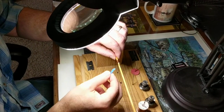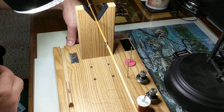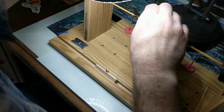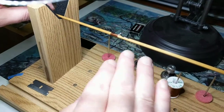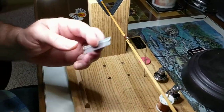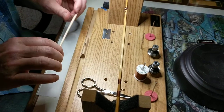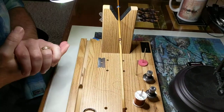Before I put these guides on, I filed down the guides such that there were no square edges and they were chamfered just a little bit so the thread rides up easily on the feet. Tools: we've got a razor blade, a pair of scissors, my nylon double-ought thread, and a little nifty fixture here. I also have a burnishing tool, just made out of wood — a soft material to squeeze the threads together as we go through the process.